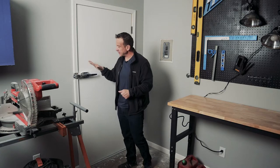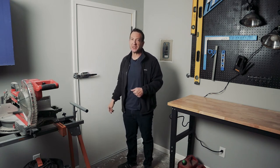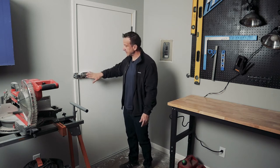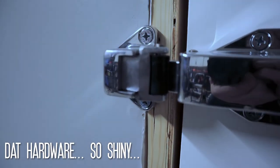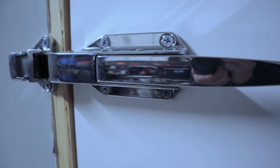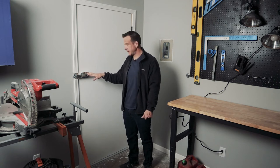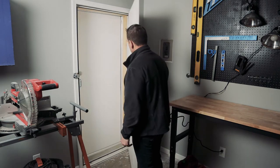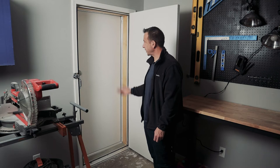And then, using hardware that would minimize penetrations in the doors themselves. And it's a double door approach. So here, obviously, this hardware is really nice in that you can get a very tight pressure against the seals that are in here, and I'll show you in a sec, and without putting too many holes or openings in the door itself. So this is how you come in. So you open this door, and like I said, as a double door approach, you have another door that you have to go through to get to the space.